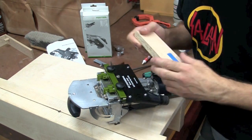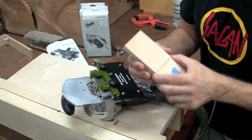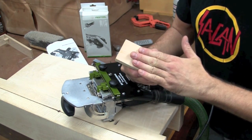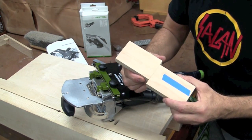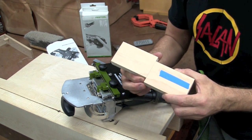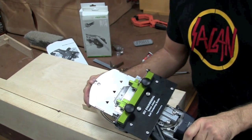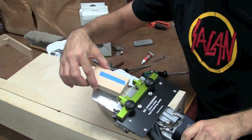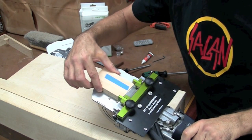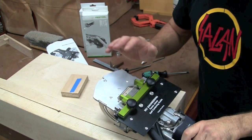To test the calibration, I'm going to cross-cut this board in half, then put a mortise in both sides and see how we did. I'll place a self-centering guide, mortise in one direction, pivot and rotate it and go the other direction. If there's any error in centering, the error is going to be doubled — so if we put it together and there's a step, the distance of that step divided by two is the amount of error. One minor complaint: I would have liked the outer edges of the guide stops to have a slight bevel, making it easier to insert the piece. The domino trim stops have that bevel and it helps.